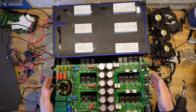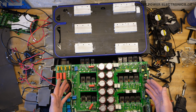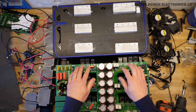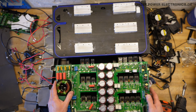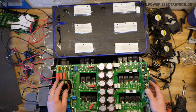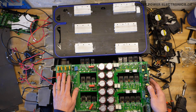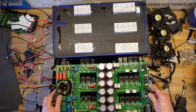That's why we see something like this get thrown out. Doesn't seem like there have been any failures — no scorch marks, no exploded devices. Hopefully all the IGBT switches are just fine and can be reused in a project, maybe even as it is. It's simply a matter of cutting up the PCB, rewiring the DC bus — all the legs are already in place — and removing all the drive circuitry. And off we go.